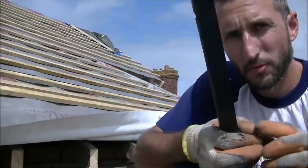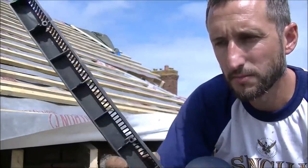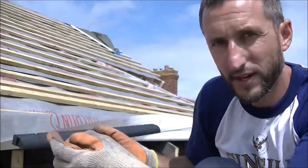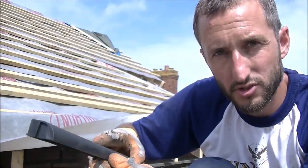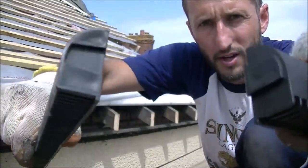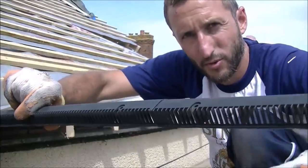Before we put the fascia board on we're going to fit these fascia vents. These just screw down to the top of the fascia — they clip over the top with little screws and nails through the top, and then we lift that up. This adds a little bit of depth to the fascia and will push up underneath the slates. On top of this we're going to put the felt support tray. If you look at these vents they've got tapered grooves so one just slots over the other so you can link them all together. You've got to make sure you do them in the right order — if you screw one down the wrong way you won't be able to get the other one underneath.